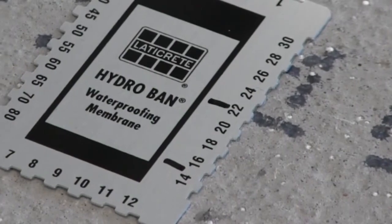Too much liquid will commonly take longer to dry and yield less square footage or square meterage. Too thin a material and it may not work as it should, if it is a waterproofing, anti-fracture, or moisture vapor membrane.